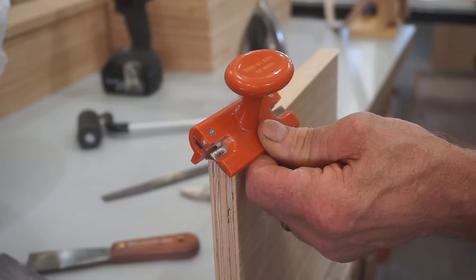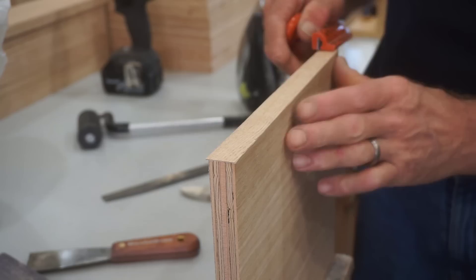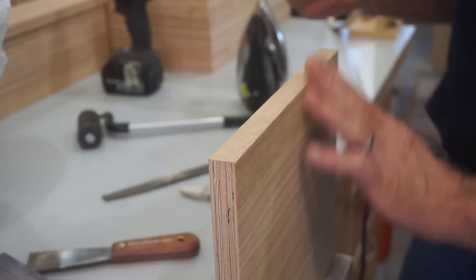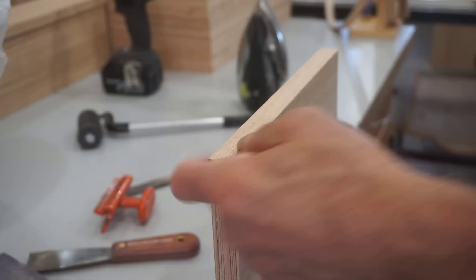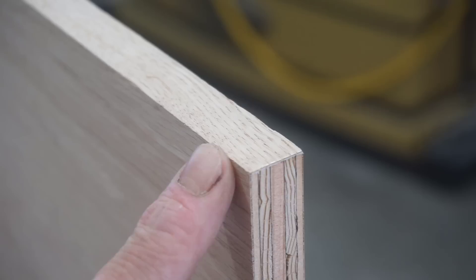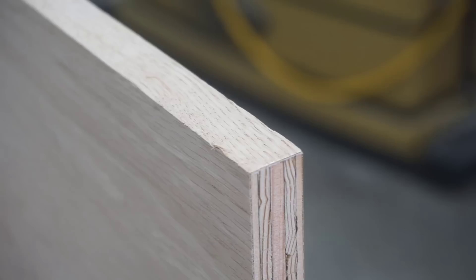By zooming in, you can see the end is cut flush now and the side edges are hanging over a little bit — that's just how I want it, so that I can trim that off with this little trimmer. With this little tool, trimming this edge off is as quick as that. I do both sides. And if I have any doubt that I missed something, I can always go backwards because this cuts going both directions. That gets the edge clean to what I'd say is 98%. But you can still feel the difference between the face of the wood and the edge banding — this edge is just ever so slightly sticking out. A commercial machine, if it's not set right, will leave that little edge — and that's what gets caught and tends to chip off. So I want to deal with it.